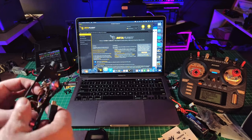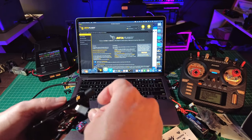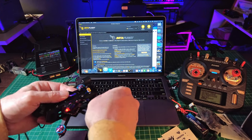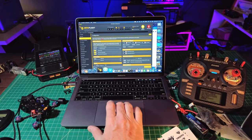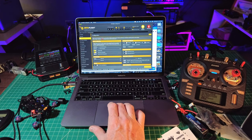Telemetry recovered — we don't need to plug in a battery to activate the channel maps. This is just a stock setting. They have magnetometer turned on — I'm going to turn that off. They have barometer turned on. So we're going to save and reboot. Looks like the OSD is set up to say Eagle 1. We want the arming maximum arm angle at 180 in case we have to use turtle mode. I'm going to turn on RX set and RX loss as well, so I have kind of an ESC beeper on here because there's no beeper on this little quad.